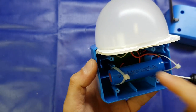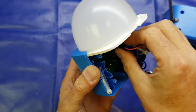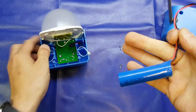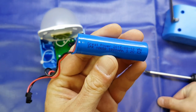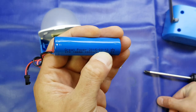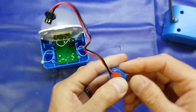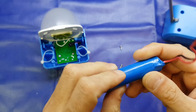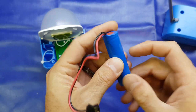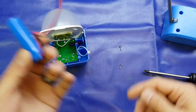The cell is just clipped in there. We can disconnect that and get it out of the way. It's a Great Power 18650, 1000 milliamp hour, 3.2 volts, manufactured 12th of August 2015. I don't know if it's got any protection on there, but it's obviously pre-terminated, probably out of the factory, given it's the original heat shrink that's on there. You can probably get these on eBay. Nice, modular design.